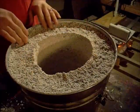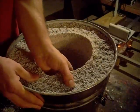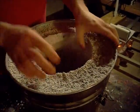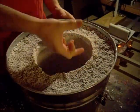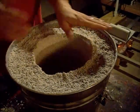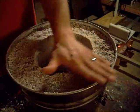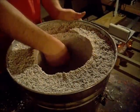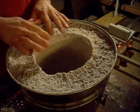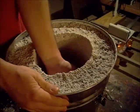I'm going to be working on sealing this up today. After it dried it actually shrunk a little bit, which surprised me. It's still a little soft down at the very bottom so I need to burn it a little bit. The top two inches got very dry using my heater, but the inner core is not as dry. I need to fill this top part with something, so I'm going to try the concrete and get it level across the top. I'm not going to do the inner liner yet because it still feels moist inside — it has that silica gel — and I think I need to burn it with a low fire before I can seal it all the way, otherwise I'll end up sealing that moisture inside.